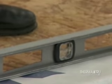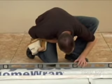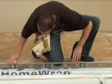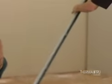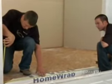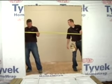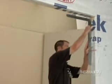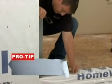When preparing the opening, first determine if the subfloor is level and solid. You must provide a flat, level, clean bearing surface so the sill may be caulked and sealed to the opening. If the subfloor is not completely level, then scrape clean, sand, or fill as required. If necessary, shim the subfloor for floor covering clearance and be sure to caulk under the shim. The opening should be unit frame height plus one-half inch, and unit frame width plus one-half to three-quarter inch. Check all corners with a framing square to be sure the opening is square, and double-check by comparing diagonal measurements. Any problems found here should be fixed prior to proceeding to step three.